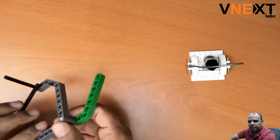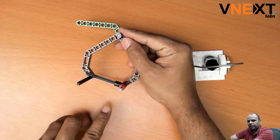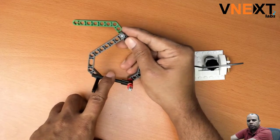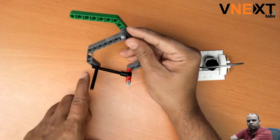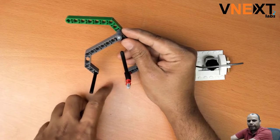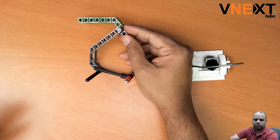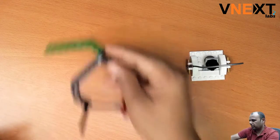Let's remove this and look at this mechanism. This arm can be pushed from the bottom — it goes to the top — but when pushed from the top, no matter how much force you apply, unless you break it, it cannot go in because it's being stopped by this other axle. This is called a one-way lockbox, and it works exactly like one-way valves — like the valves in your heart that let blood in but won't let it push back.